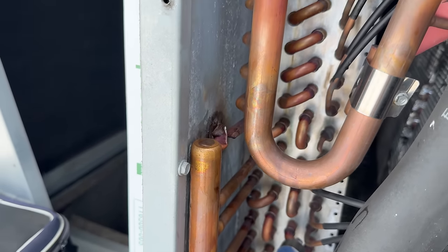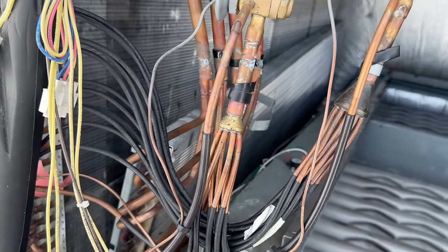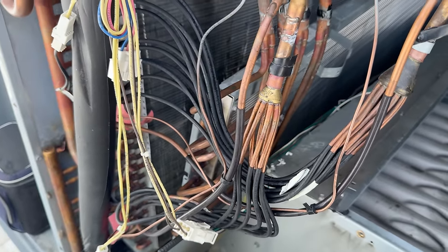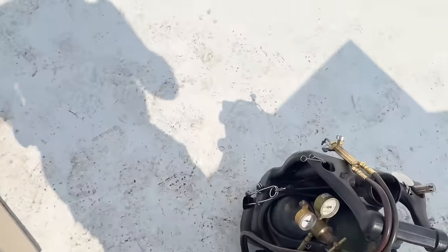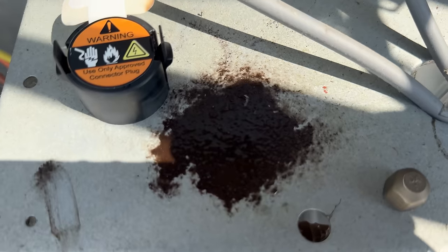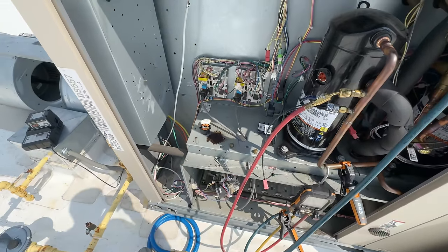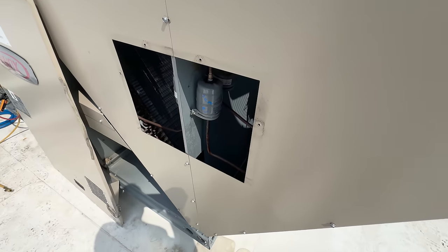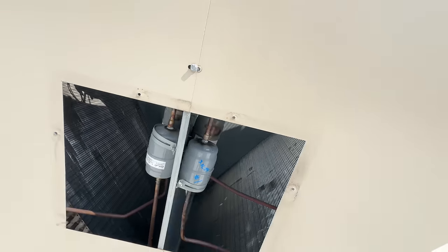As bad as that whole section was, it kind of scares me, but it would have been a lot quicker to do there off the bat. That's the problem with noise — it just travels right through the coils. Let's go ahead and throw it back together and pull back on this thing, get the vacuum going. You can see the crap that was in the system. That's what was in the reheat valve, so I'm sure this is going to be really good. Got a new dryer on it. You can tell other problems must have existed because those don't look like factory welds.